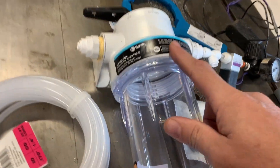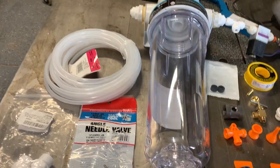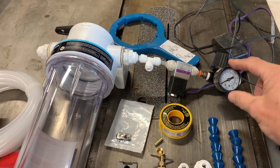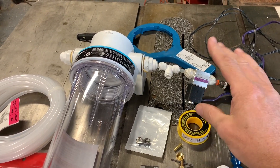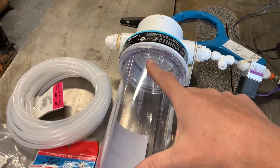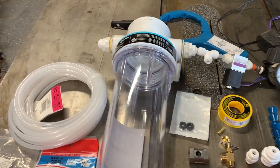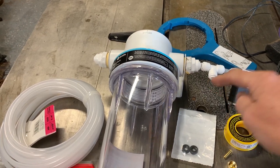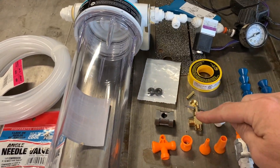This is an A.O. Smith whole house water filter. I took the filter part out — this guy is going to shove up in there and we're going to pressurize it. There's a solenoid here and a regulator here, so we'll probably put 20 to 25 pounds of pressure on this side. This solenoid will be controlled by the Tormach — it's the coolant on/off, which is awesome. So we'll have pressurized line coming through here, it'll pressurize this canister which will be full of WD-40, and then that will force it up through the bottom and out through that side. This T-coupler is so that I can get just straight air inside the unit, and then this little dude is going to mix air and pressurized WD-40 along with the needle valve.